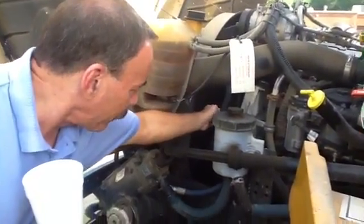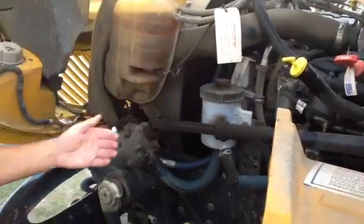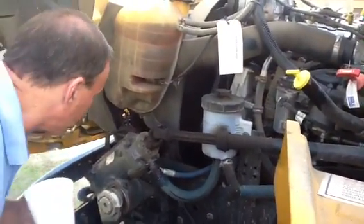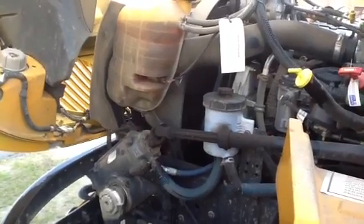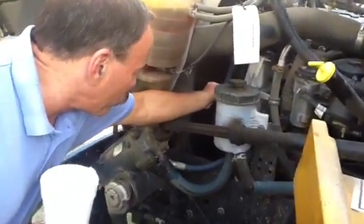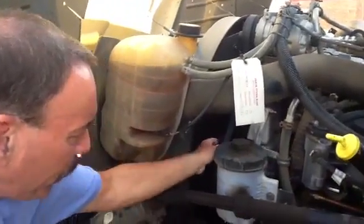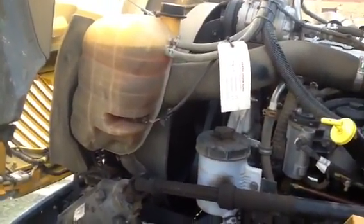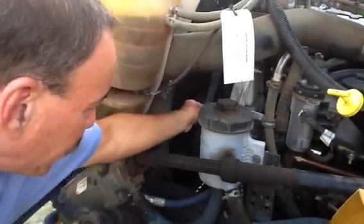When we're looking at the front, let's look at our belts. Based on a look and a pull, they seem to be visually in good shape. They're not broken, not cracked, not frayed in any way. They appear to be in good working order, and you expect to have a play from a half to three-quarter inch — maximum three-quarter inch.